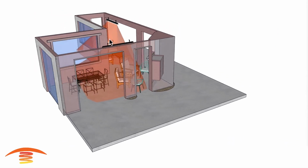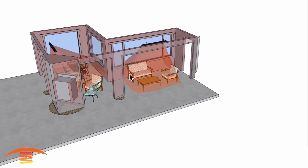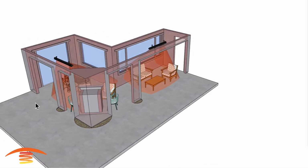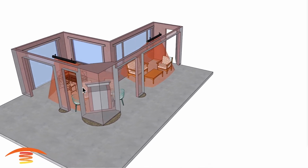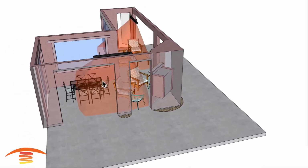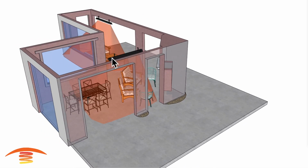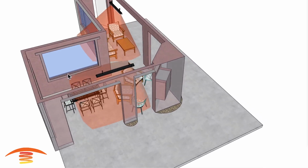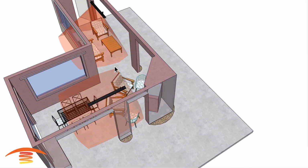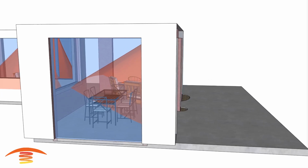But what I was going to say earlier, a few minutes ago, is the fact that this is the exposed side of the patio. So air movement comes through here. Maybe it's from this direction, but when you have the exposed side, you really want to make sure that you're offsetting that exposed side by placing a heater, at least if you don't place it above the center, then at least on the outer edge. So I prefer heaters to be placed really over the center, but I'm trying to make this as visually pleasing as possible and still effective as possible.